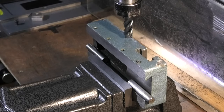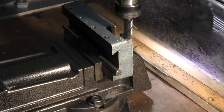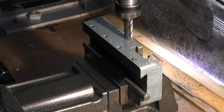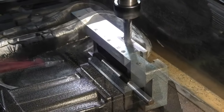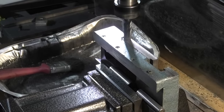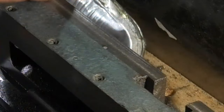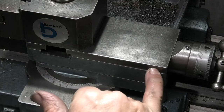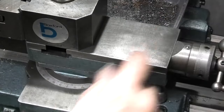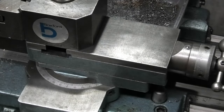12mm end mill. The milling cutter is just touching on each end, so that shows that when the casting was originally machined it was set true to the raw casting. There I'll have a nice flat surface, so now I have a face on this side and the other side where I can run a dial indicator along to get the angle of the compound slide.